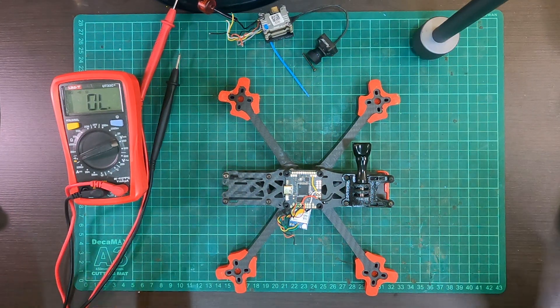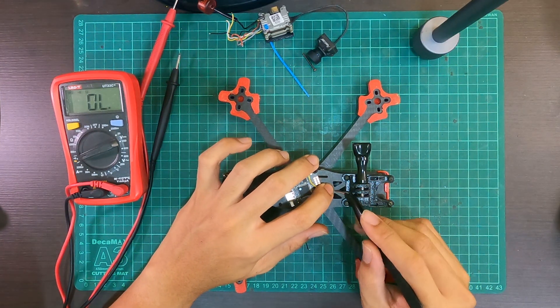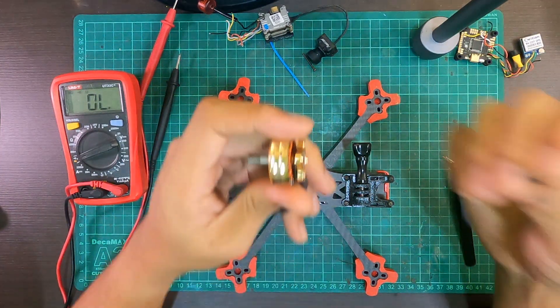And that's how I basically fixed my air unit when it was grounded. As an addition, I'll mention a few other things that might cause your whole carbon fiber frame to be grounded. The obvious one would be a ground wire that happens to be cut through and the bare end makes contact with the frame — that could also ground the frame.